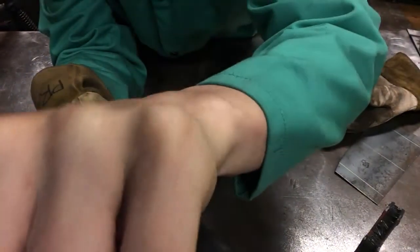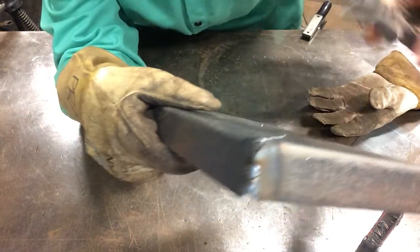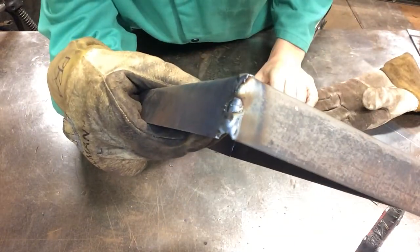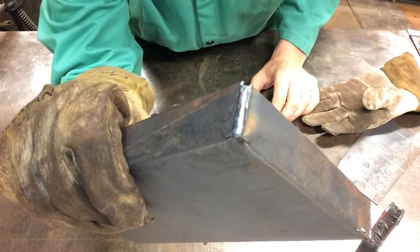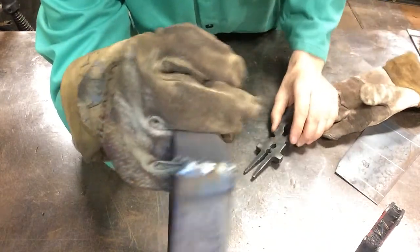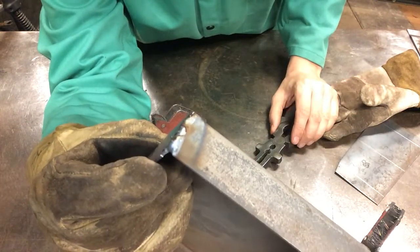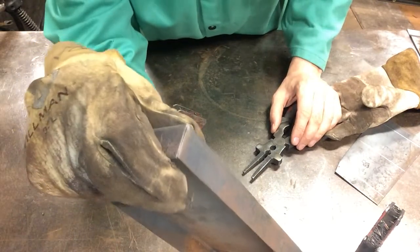What we have now is a fully closed weld. There's a little artifact of the MIG wire overshooting that just breaks right off, but it's relatively clean. Comparing that with the tighter tolerance weld, which is much more uniform in bead shape — this one is a little lumpier. We've kind of burned through the edge on the back side, and it's generally just more work — maybe five to ten minutes with a belt sander to get it to a nice clean profile, but only if you're really worried about it.